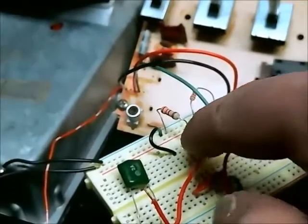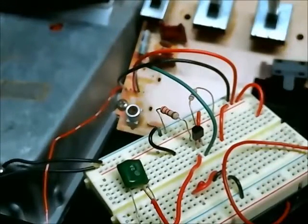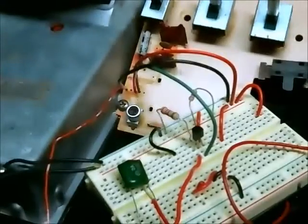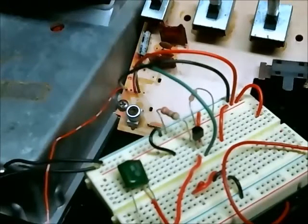Not my gaming skills, obviously. The video quality is pretty good and the audio is decent. That sound is part of the game — it's meant to resemble a beehive. If I hit reset, that buzzing goes away, so it's part of the atmosphere. The next step is to place this transistor and resistors onto a perf board, solder it in place within the case, and get some RCA jacks on the output — two for audio, one for video — so I can connect it to a modern television.